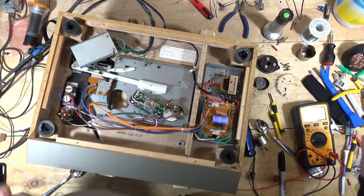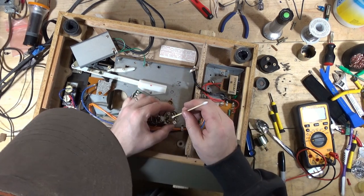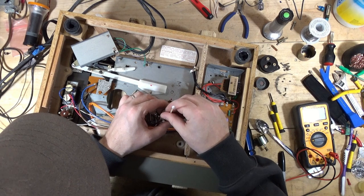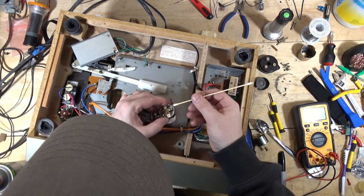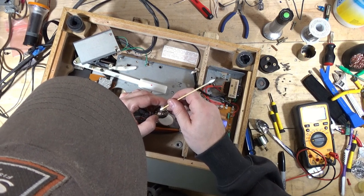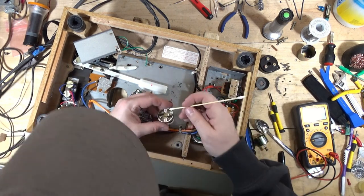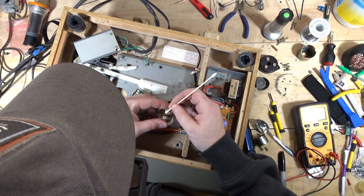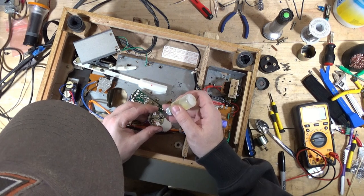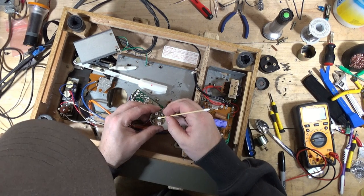And then down here, I'm going to want to take my contact cleaner and I want to move this between those two arms right there. Spin it. Again, not a lot of carbon's coming off of there. And a couple of drops, and you don't want to touch the arms, a couple of drops of oil down in that little hole. Okay. Just to be safe, let's hit those one more time.